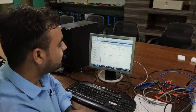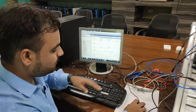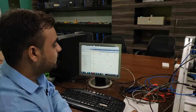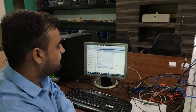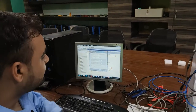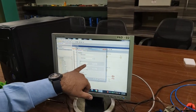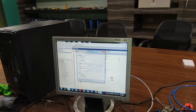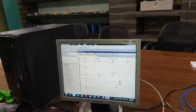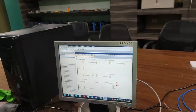We download the forward counting program to the PLC. In this program we have defined 5 counts for the forward movement of the double acting cylinder's piston during multi-cycle operation. We can change this count as required. The on-count starts at zero, the program runs and counts the cylinder cycles, and after 5 counts the operation switches off. We download this program to the PLC.